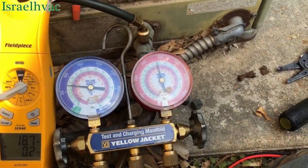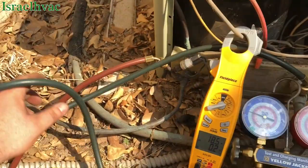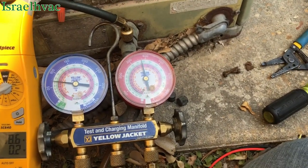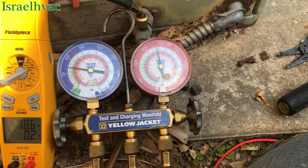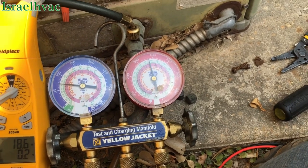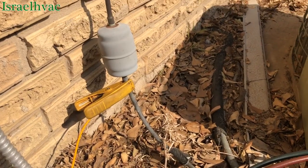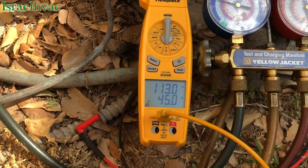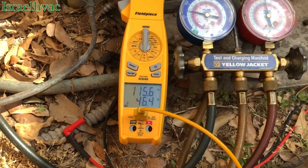I removed a little bit of gas to keep the head pressure under 400. I'm going to take a temperature reading on the inside of that dryer to see if it's plugged up. There's no TXV inside — it's a piston. I went and got a pipe clamp off my S-man because it'll hook to my meter. Going into the dryer: 113, 114, 115 degrees. That's hot.